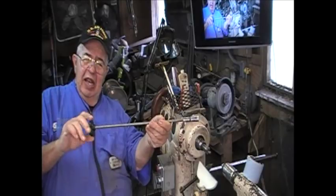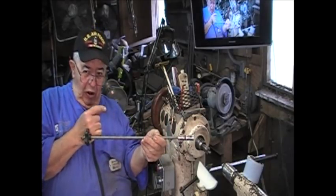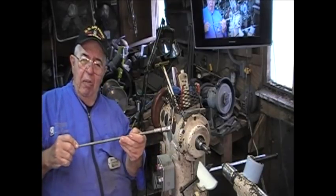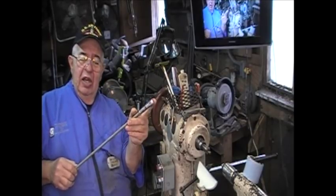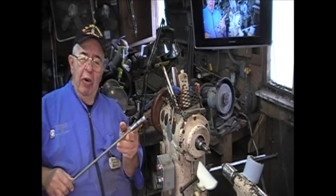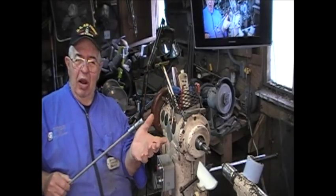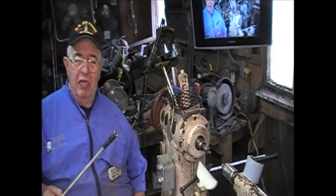When I hang this down to the flywheel on the far side, the furthest left side of the lathe, when I tighten this down, it's going to pull the drawbar back. That's going to pull this back. That's going to lock down my collet. So, if I put a 3/8 inch hardwood dowel here with a block on it to turn a bottle stopper, or a 1/4 inch one that's sweet for Christmas tree lights,